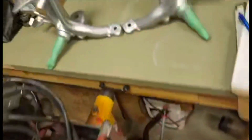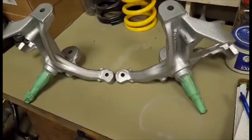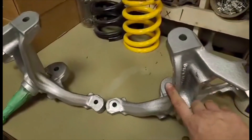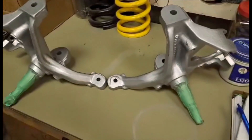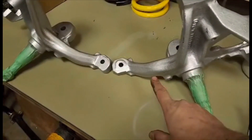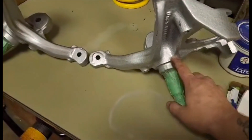This is the finished product of Bill when he has sandblasted, cleaned off, and deburred all the edges. Give them a coat of paint — that way if they bend, you can see the paint will flake, or if they get hot, this will discolor.